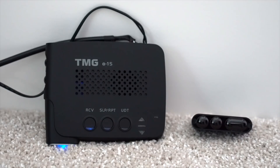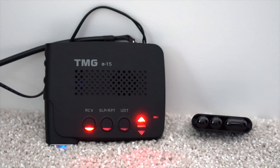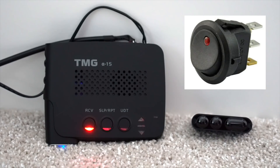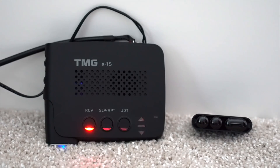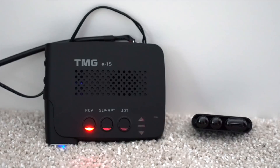Next, let's take a quick look at what happens if you had it set to auto JTK — so four second JTK — and you press the receive button to try to disable the jammers more quickly. So you can see we do have the ability to disable the jammers more quickly if we like, but again it's not 100% here with this jammer. If you're looking for more consistent jamming — to reliably do it every single time — something you can actually do is wire in an external power kill switch that you can just press and it will instantly cut power to the system entirely and 100% of the time will shut it off.